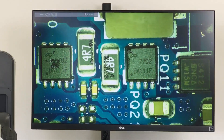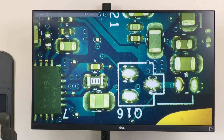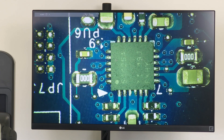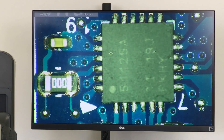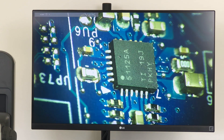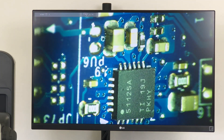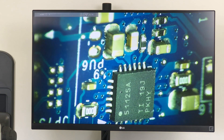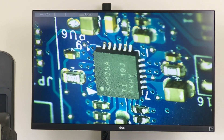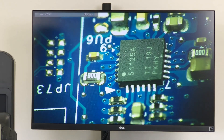In direct view it allows you to scan around a board looking for component placement problems or missing components. When you come to a multi-leaded component that you would normally pick up the board to tilt and inspect, we can easily bring in the oblique viewer, which now gives you an angled view of the subject that we can zoom up. It retains its focus and walk 360 degrees around that given feature, inspecting all sides without having to tip the board while the board remains in focus.